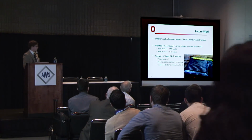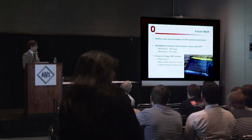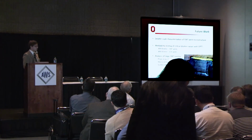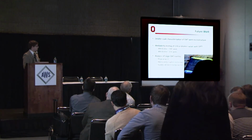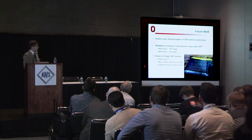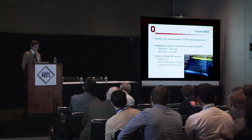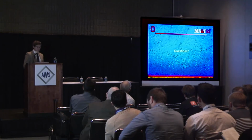We're also doing analysis of a large CMT overlay that we made in-house with phased array ultrasonic testing, macro section optical microscopy, and guided side bend mechanical tests. So with that, I'll open the floor to questions.